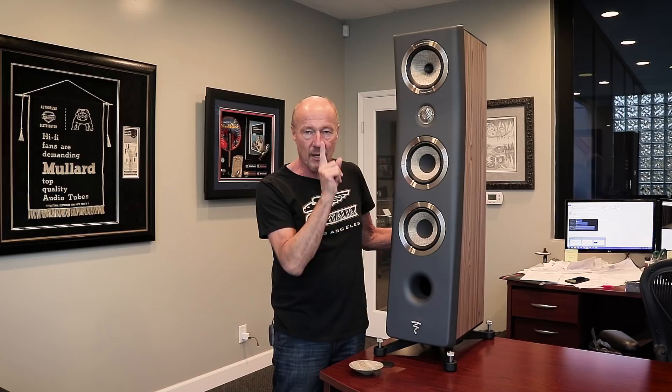You can see that easily by looking at the specifications. This speaker is about 90–92 dB efficient. It requires about half the amount of power compared to other competitive speakers in its class. That means you can use it with a 30-watt tube amp and it will rock your world. Solid-state amps, even if they're not big ballsy amps, will make the speaker come alive. That's because of engineering. The Poron suspension gets rid of the resonant frequency, which makes the crossover simpler and less oppressive.